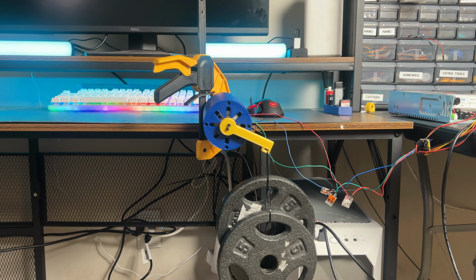Okay, so the rotation is good and ready to go. Quick test. So now I'm just gonna attach the tilt stepper motor onto the rotation one, and we're gonna test both of them out with the camera and see how that goes. So I have the code set to where if it's between 5 and -5, it doesn't move, that's like the stable part. But if I go left, it goes left. Go back to the center, go right. Now up. And we're in pretty good business, baby.